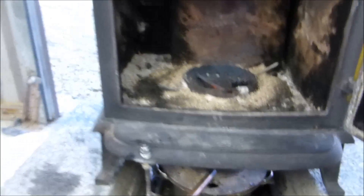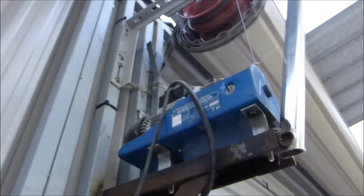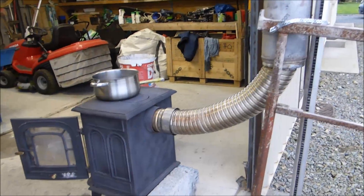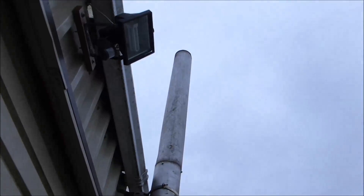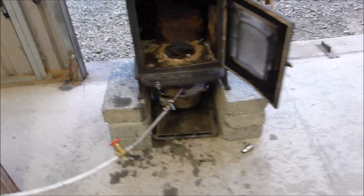I used 3 meters of flex — that's just a winch I bought in a shop called Aldi — and it brings my door up and down. So very easy to set up. This is purely temporary, I don't want to drill any holes in the roof. But in any case, this is just something to do. A bit of flexi flue — I think it's 5 inch flexi flue — into a 6 inch flue. It goes up about 3 meters: two 1.5 meter sections and what looks like half a meter, so 3 and a half meters of flue. The flue is massively important because it makes the draw, it makes the roar, and it causes the combustion to happen. It sucks the air in through the holes to mix with the flame and keeps the whole thing going.